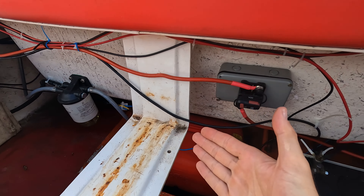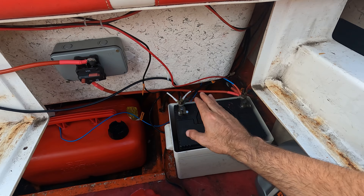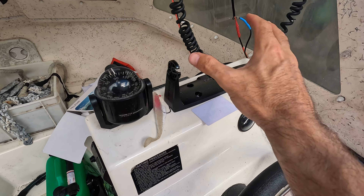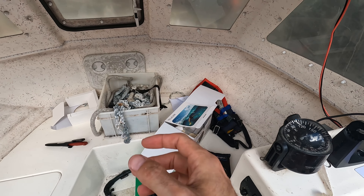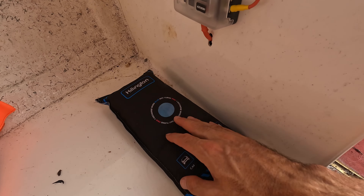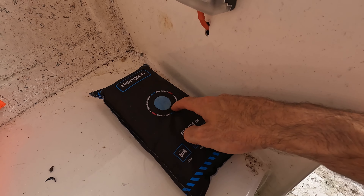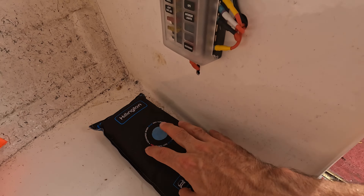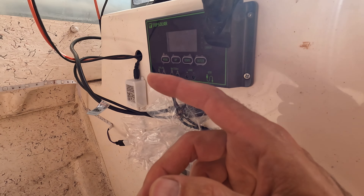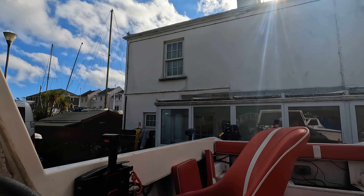The outboards and fuel system are all sorted. I've put some dielectric grease on the battery connections. The battery is going to remain in position — I have a solar panel charger, and a couple of times over winter I'll put it on a trickle charge. This is Britain — it doesn't get to minus 10 or anything, but we will expect some below-freezing temperatures. I've taken the fish finder out and I'm going to drop a camera in there, accessible via 4G. All the electrics are fully isolated. I'm also putting in one of these little dehumidifying absorbent crystals — when it goes pink, microwave it for two minutes and put it back. It's getting a good charge through the solar panel right now on this beautiful September day.